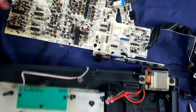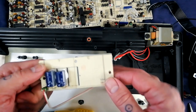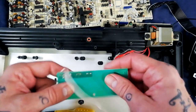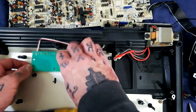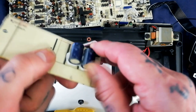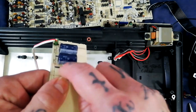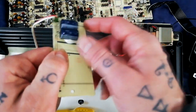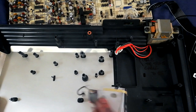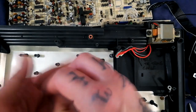We'll get these screws out and look at the little board underneath - that's a pair of capacitors for filter purposes, not leaking; the white stuff is just glue to stop them rattling. They look healthy - flat, not bulging - so it's unlikely they need replacing. You can see there's shielding underneath mostly held down with double-sided tape - I wouldn't bother removing that unless absolutely necessary. Let's get these upper PCBs separate from the case, starting with the one on the left.